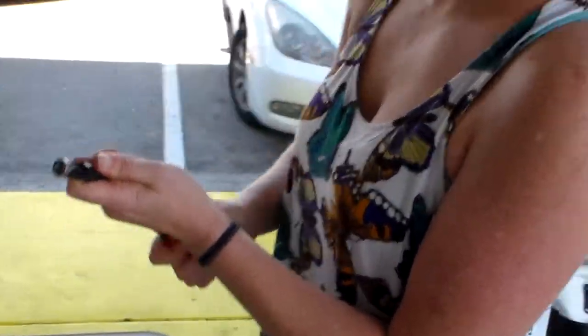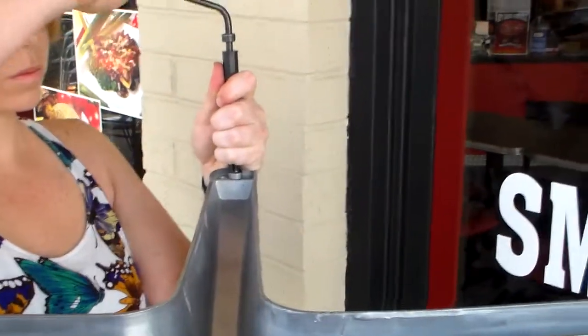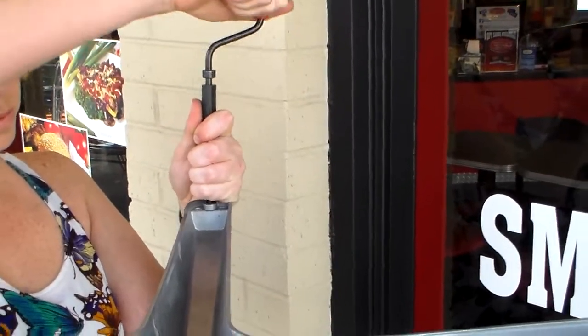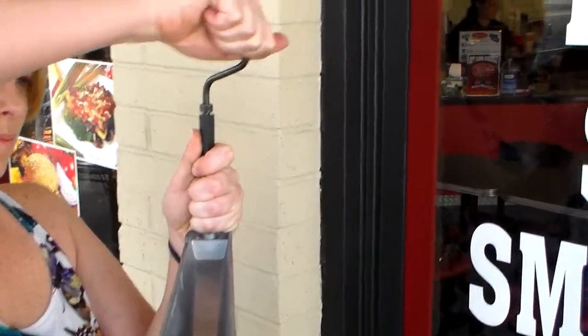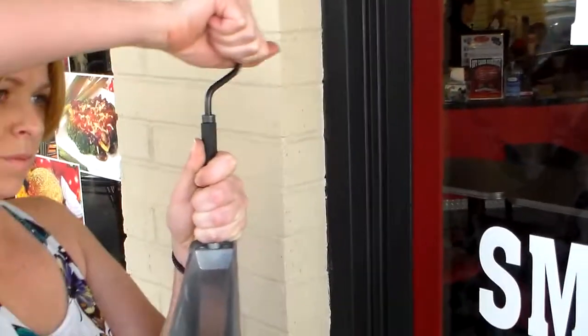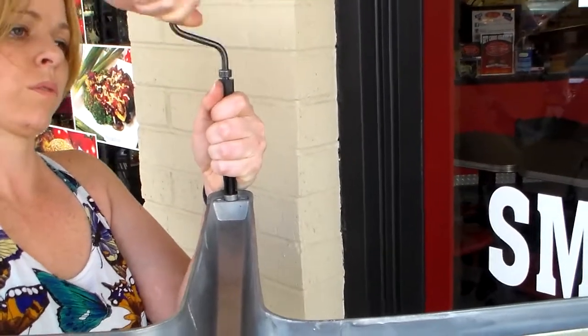That was already in. Okay, I've already done this to the unistrut, so she's doing the last one with the helicoil. As you can see, she's just winding it in. You see the stop right there that I've got preset up top with an Allen wrench. Preset, so that when she gets to that, she backs it out.